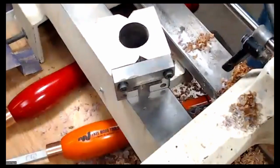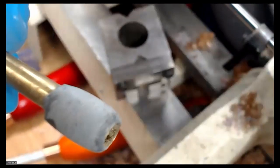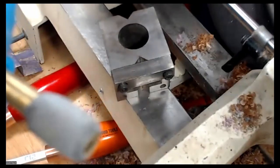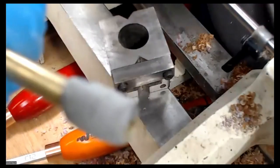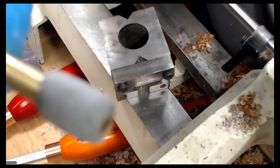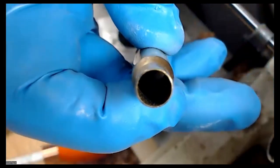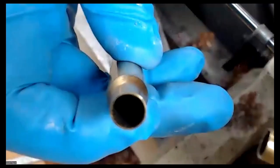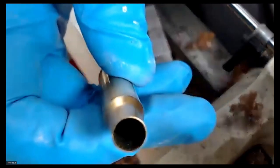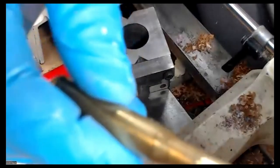Now, you have to take some form of epoxy. You could wrap tape around it. You could use regular one minute epoxy. I used JB Weld on here because the inside of that hole isn't 7 millimeters. It's a little bigger, 20 thousandths bigger to be exact. So this flops around in here.